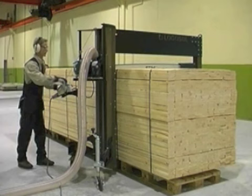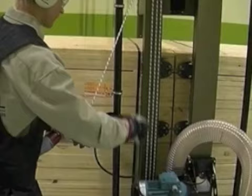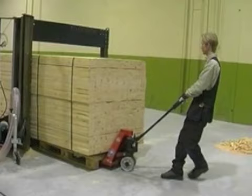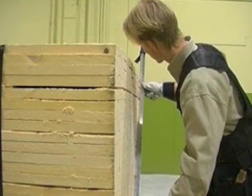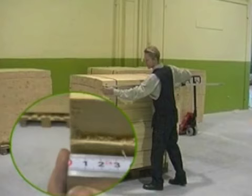Now all that's left is on with the safety gear, connect up the power and start cutting. When you've cut through the stack, you should move it before you wind up the guide bar. Release the screws, sighting rod and locking lever. Take the measuring rod and check that the surface is true and that the dimensions are right. The margin of error is a few millimetres, provided that the cutter is properly adjusted and that the chain is in good condition.